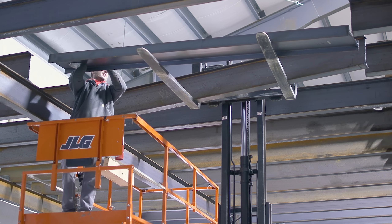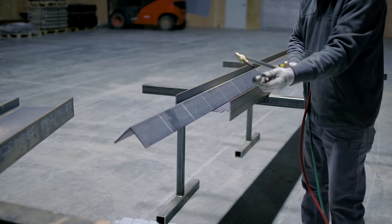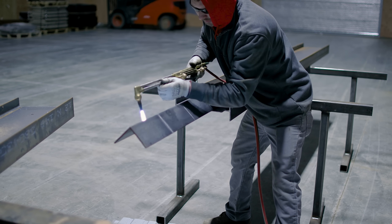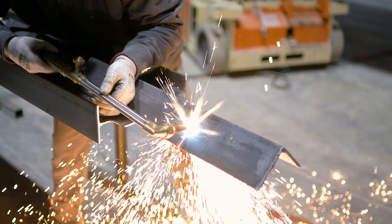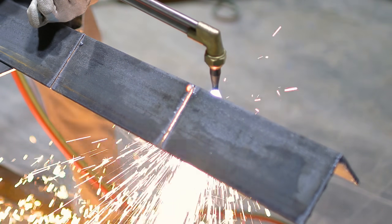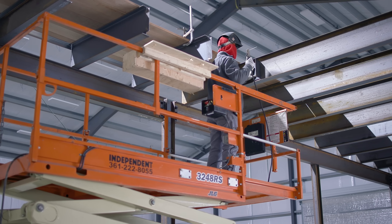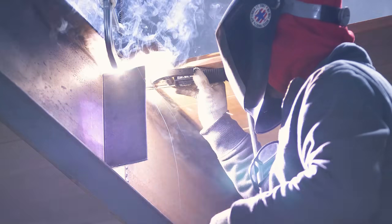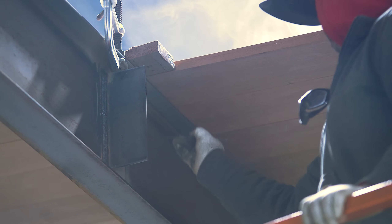There are now three little tails of joists dangling into nothing and I need to tie and support them. I'm going to cut some angle iron and attach them to the adjacent beams on the sides. It's really cold outside so having a larger tip gives me a lot of preheat really fast — I can almost cut as fast as a band saw. I position my material with both legs pointed down, allowing me to make two quick swipes without moving or rolling the material. I'm using angle iron instead of flat plate for the knife plate because it gussets and strengthens the web of the joist.